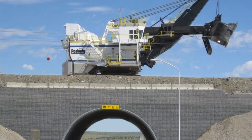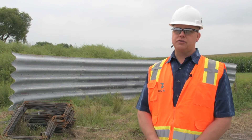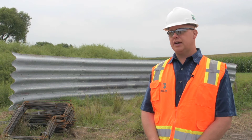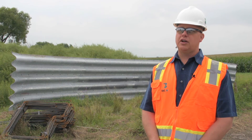If you take advantage of the flexibility of the bridge structure, you can often save significant money with the foundations. Even if the structures cost the same, using a flexible buried structure can save as much as 40 to 50 percent of the project cost just by changing the foundation type, because it's a flexible structure and you can design the foundations based on the settlement tolerance of the structure.